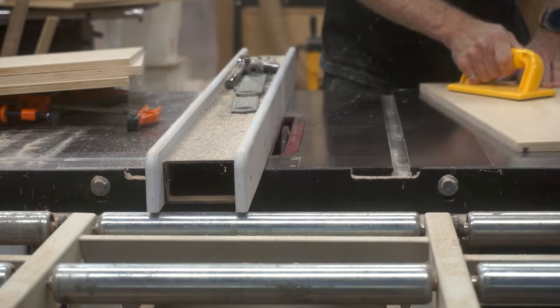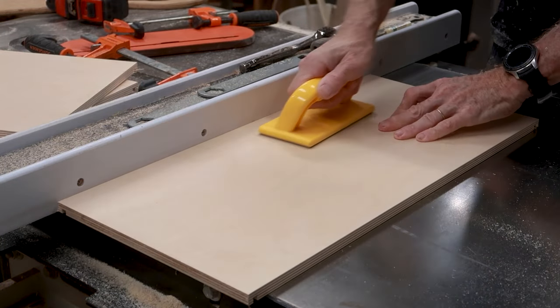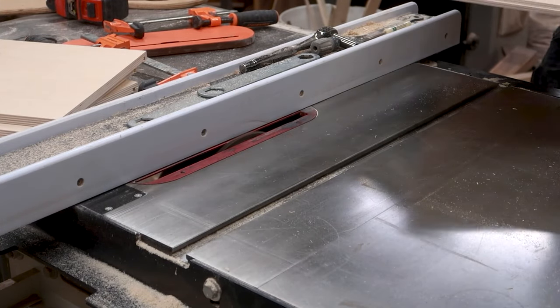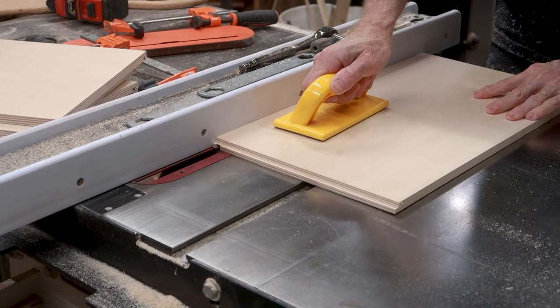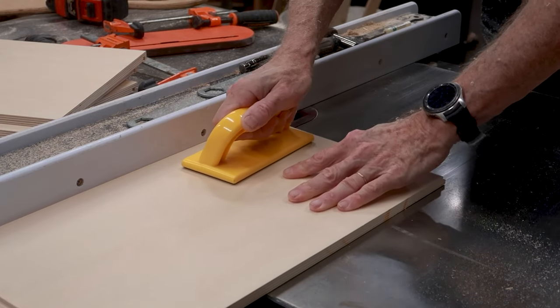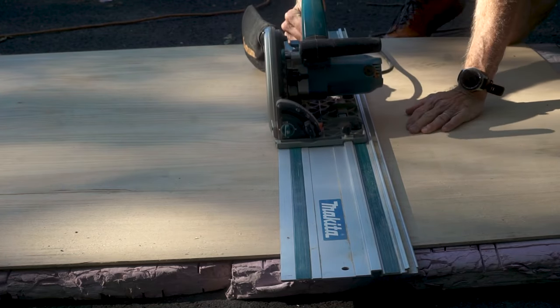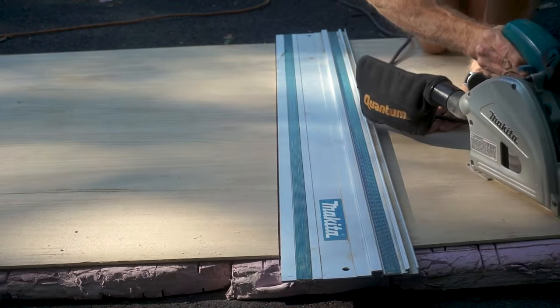I'm not using Baltic birch for the plywood bottoms, so the plywood will be a little undersized for the groove, but a little glue will hold them in place. So with that single setup, I can cut all of the joinery for the 6 drawers very efficiently. Next, I'll cut the drawer bottoms and then proceed to glue everything up.